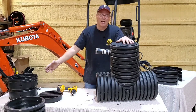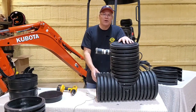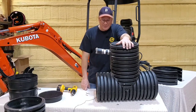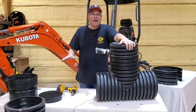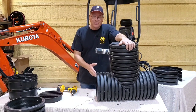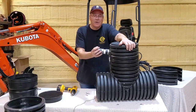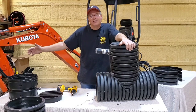So in the north, I like added chamber length because you're displacing more volume of water, and you don't have to worry about the pump going on and off until it burns up. When you're short cycling a pump like that, it'll typically last about 30 days, but it's nonstop. Again, in the south, you can use a check valve, but for your on-site storage, say you're on vacation and the power goes out, so the pump can't run, make sure you have enough added chamber for some on-site storage.